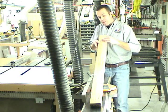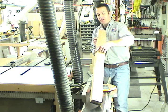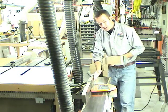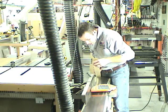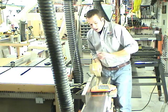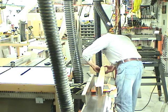With the face of our board flat, we're now going to make sure that the bottom of the fence — the part that will go onto the main board — is 90 degrees to the face of the fence. The part that we just flattened will go against the fence of the jointer, and I'm just going to mark this with a triangle to indicate the right angle we've created, so when we go over to the planer we'll know which way to orient the board.